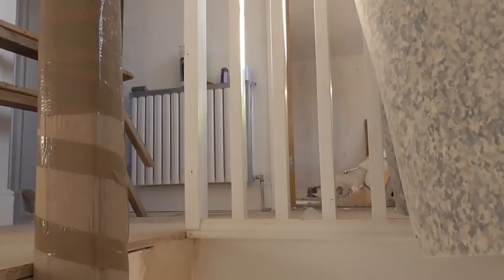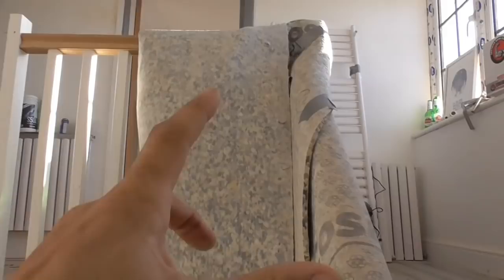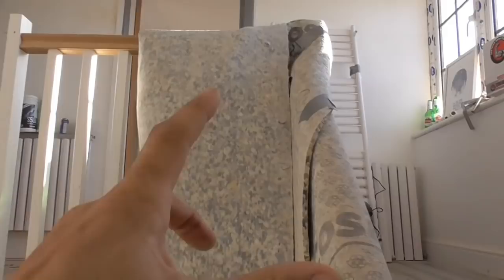We don't need to worry too much about cutting the newels round over the floor because they're not going to be wobbly — what they'll actually do is find their support through the handrail back onto the actual staircase newel, which as you can see here is housed over the joist, so that's nice and strong. So let's get this piece of timber, this nosing first, and see how we get on.